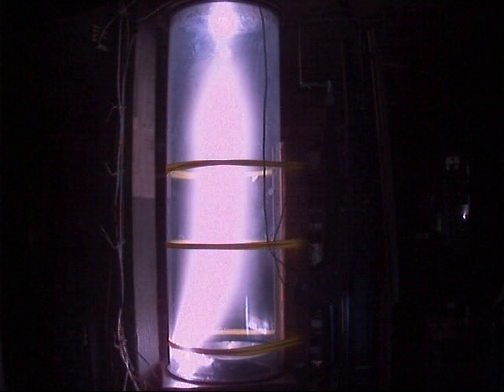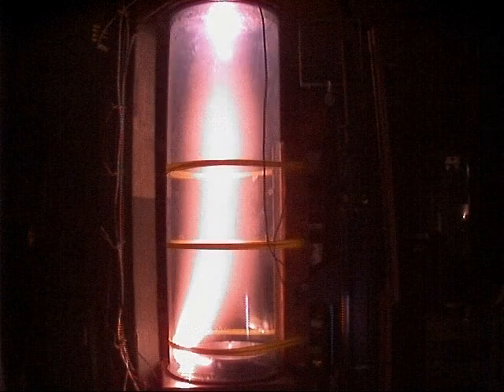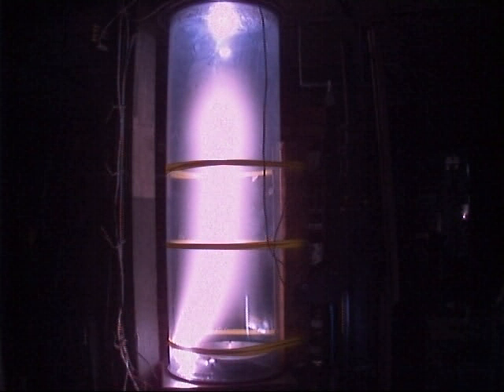I'm pushing the current a little higher. Sitting at five amps now. I'm going to see if I can back it up just a scoche. It's fluttered. Striped. Overload. Overload. It's ionized. It's going to strike. Quarter-amp strike. Three-amp strike. Those colors are fairly representative, except there's not as much blue as you see. And now it's at four amps.